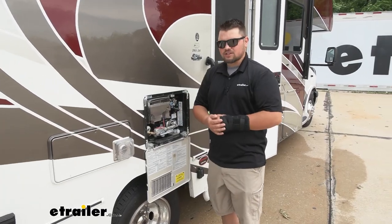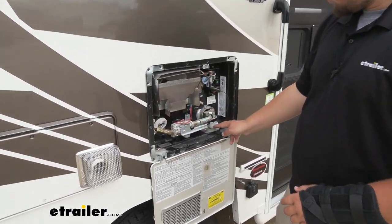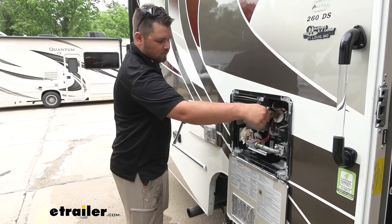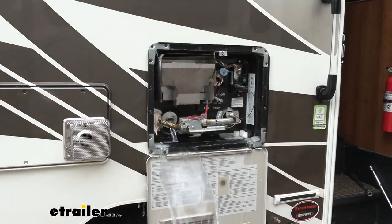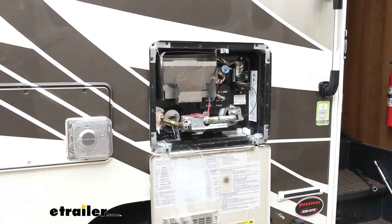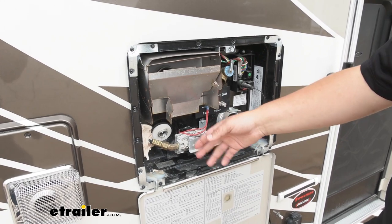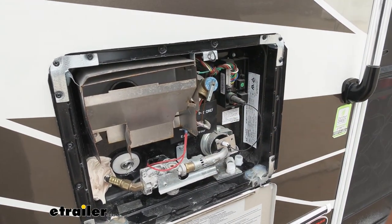We then want to come outside to our water heater — we're going to have a drain plug here. We'll get that removed using a 7/8 socket, then come up to this air valve and shift that open so the water flows out a little bit smoother. Once dry, we'll close this valve and we're ready to take out our old pump.